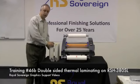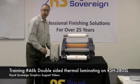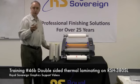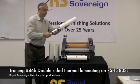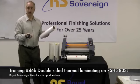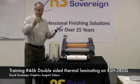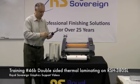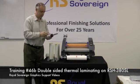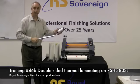The material that we're going to be running today has a one-inch core, so we're going to have to change the adapters to the one-inch core adapters from the ones that are supplied with the machine. These are the two and a quarter inch adapters. What we need to do is take our allen wrench and loosen up the adapters by turning out these screws and slotting this off.